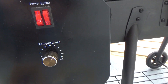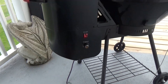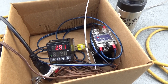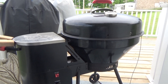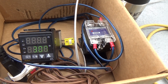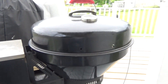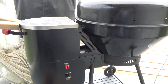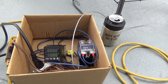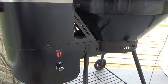With my auger speed set there and the PID set to 300, let's see how long it takes to come up to 300 - it won't take long. So far this experiment is working out. We're creeping up on that 300 mark - look at that, 296, 297. I'm digging it! You can hear it - quick little bursts of the auger and fan.